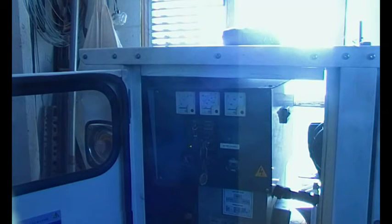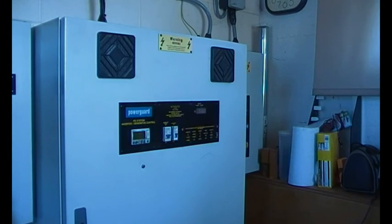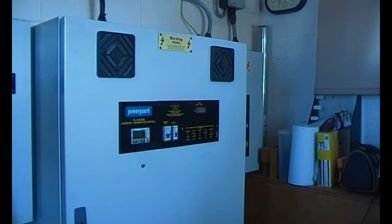If you are totally off-grid, when you want to use welding equipment, the washing machine, or things like that, you may very well switch the generator on, and whilst you're using the heavy equipment it's charging the batteries at the same time — because the charger and everything is permanently wired in, including a big charger in that large inverter. It's all remotely controlled, and whilst a good awareness of the system is vital, if things can happen automatically it stops things going badly wrong.